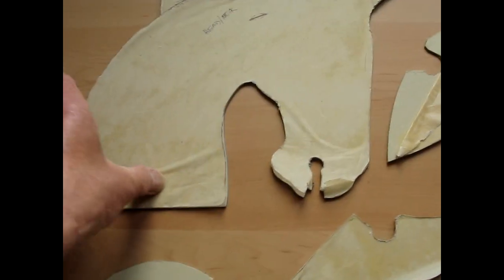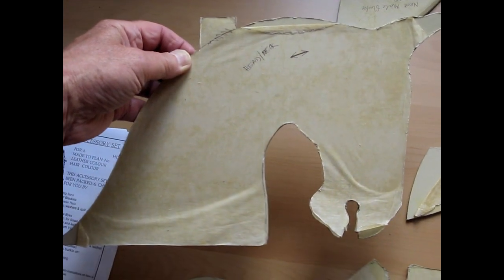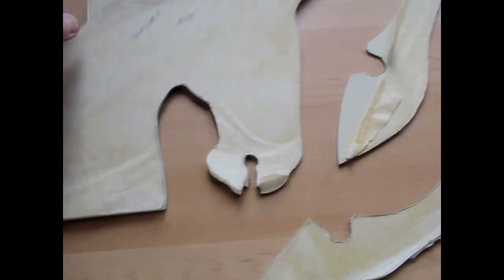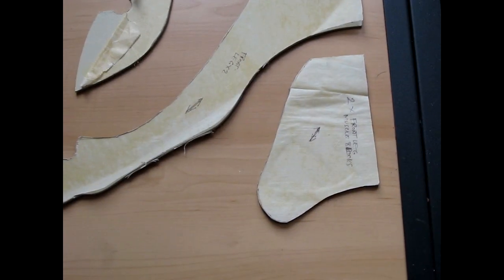In the home workshop I put the timber through the thicknesser, planed and cut it to the sizes provided in the plans. I didn't follow the stand plans precisely because I don't have a woodworking lathe, so the turned supports were replaced by shaped blocks. I used my bandsaw to cut the leg shapes and the head as well.